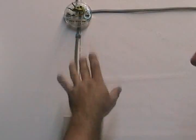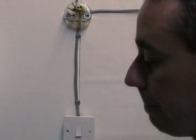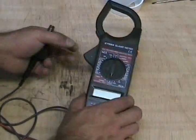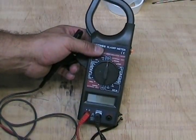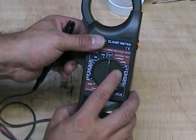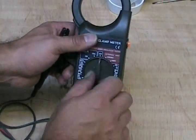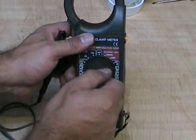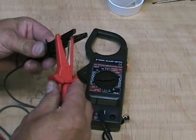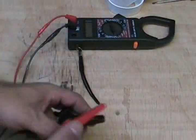I'm going to show you now how to find the switch live wire using a domestic test meter. This is my test meter — it's only a cheap one but it does the job. You can spend a few hundred pounds on one of these, but for domestic use you only really need a cheap one like this. We're looking for ohms to measure resistance, and I also put it on the bleep test so you know when you've got the correct wires. If we touch those two together now there should be no resistance and the tester will bleep.